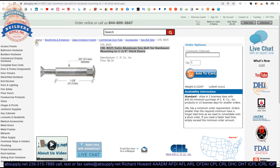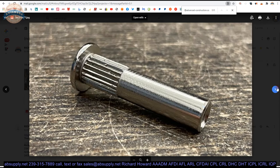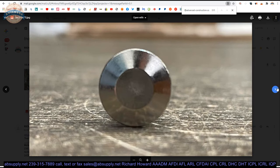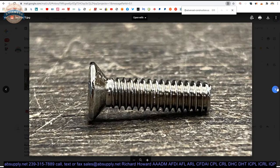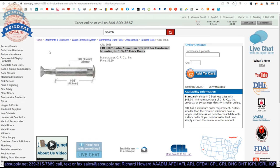Let's take a look at some images posted below. Here is the packaging, everything removed from the packaging, the female half only, side view, the opposite end, the bolt itself, a couple of different perspectives on the bolt, and then it assembled. Four in a package would be typical. It's unusual to need these in multiples other than four, though you might need four for an exit device — two at the head case, two at the end cap area. Generally with exit devices there are 10-24 size sex bolts; quarter 20 is when you're dealing with door closers. Push and pull hardware can deal with material greater than quarter 20 — thread types through-bolted at 5/16 or 3/8.